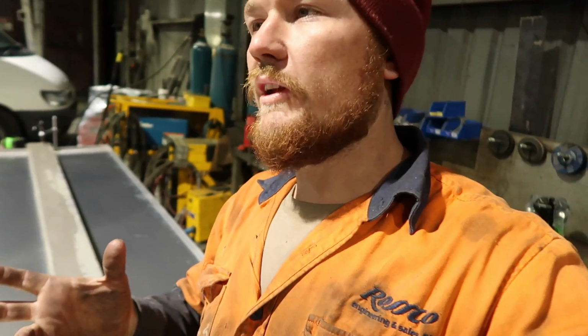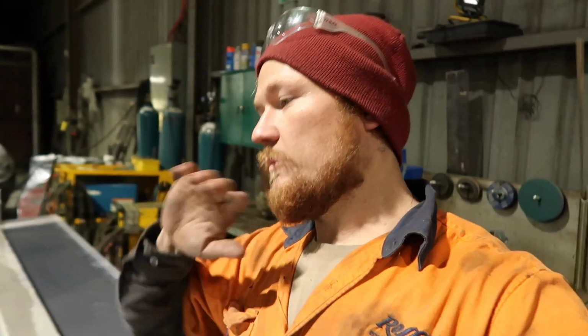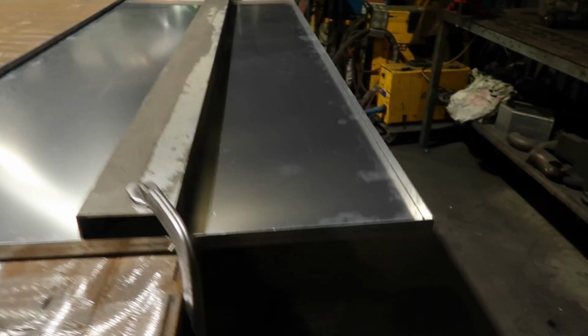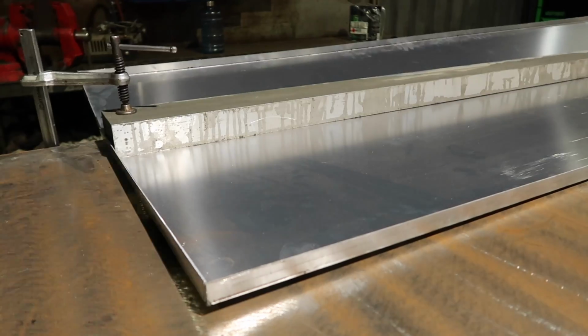Couldn't do the final fold in the press brake or the pan brake because our press brake doesn't have the removable dividable blade, and the pan brake is 1200 long, but that's not to worry. Just got a piece that's the same length, clamped it to the bench, and that should fold up, and tack weld that gap when it closes, put it up against the canopy.